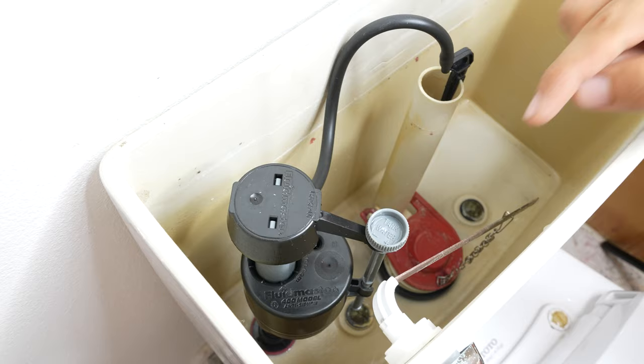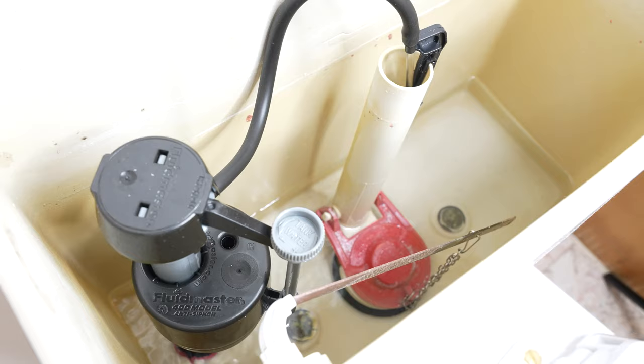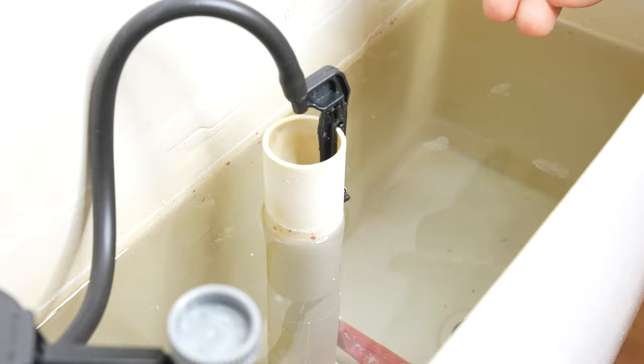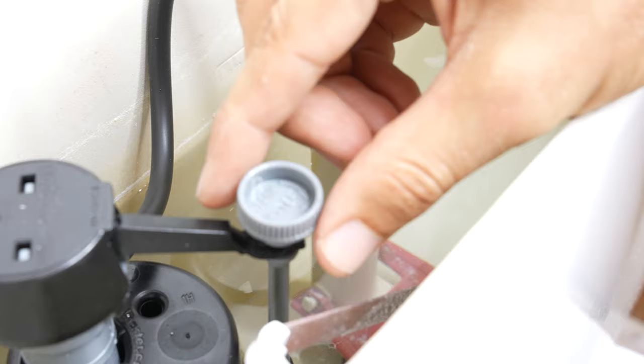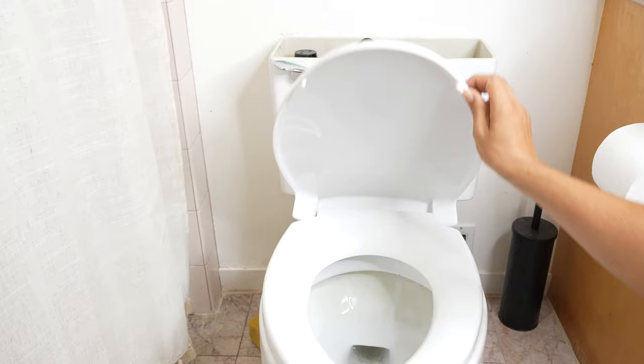Go ahead and hook the hose back up. Take one last look inside the tank to make sure that everything is lining up and nothing moved while tightening. One more thing: check that the adjusting arm is not hitting the flush lever — they shouldn't be getting in the way of each other. Now we're ready to turn the water back on and fill the tank up. Once the tank fills up, check your water level and make sure it's pretty full — generally you want about half an inch from the top of the pipe. If you need to adjust, turn the knob clockwise to fill more or counterclockwise to fill less.